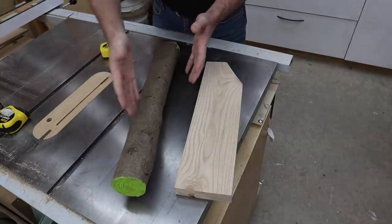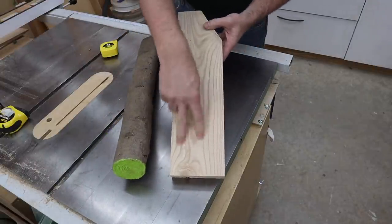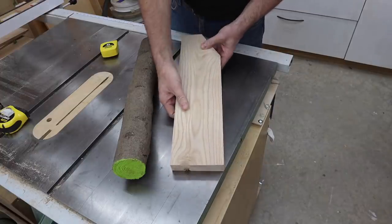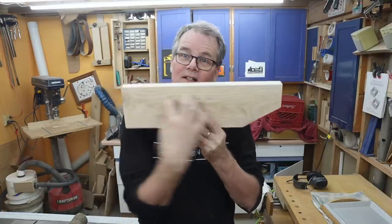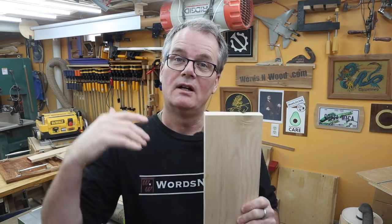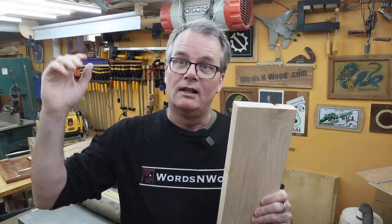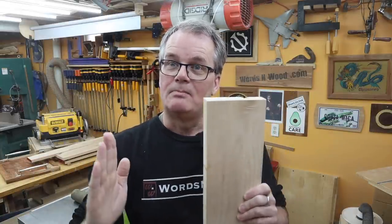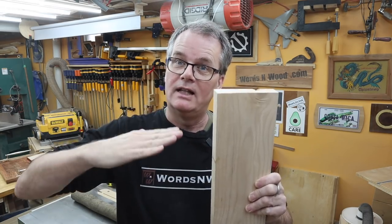Here's a chunk of tree. If this was a large log and you cut that up into boards you'd end up with something like that. This corresponds to the length that the tree grows, and here I picked a piece of ash which has really prominent lines — you can see the grain lines on this. If you look at the end of the board you can see the growth rings as if you would cut the tree off in a slice. So every board has got long grain and end grain, and it comes from a tree. It's a natural organic item and it changes throughout the year. Over the course of the year your board is going to grow or shrink along with the humidity in the air. Where I live it gets hot and humid in the summer — the board's going to grow a bit — and in the wintertime it becomes drier and less humid and the board is going to shrink again. And I'm going sideways on purpose because it's almost always in the width that your board grows and shrinks. It doesn't really grow or shrink lengthwise. Yes, that depends on the wood and a whole lot of things — I'm trying to keep this at a high level.